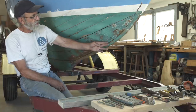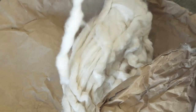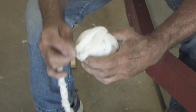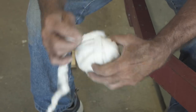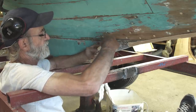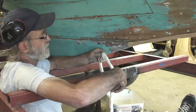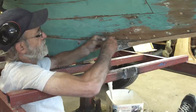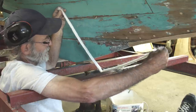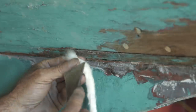We only have a very few things left to do — caulk it with some cotton and put some plugs in the bolt holes here. I've gotten out a ream of cotton and I'm balling it up so it's easier to use. I don't have to keep going back to the ream; I always do it the same way — take the ream, open it up, ball up the cotton, throw it into my little bucket. I'm actually only going to use probably half a strand because these seams are pretty tight, and a whole strand would be a little bit tricky. So I'm going to rip off a piece right here and split it right down the middle. All the cotton is longitudinal in there, so you can go from one end to the other and never come off the side. I'm going to start it off right here.